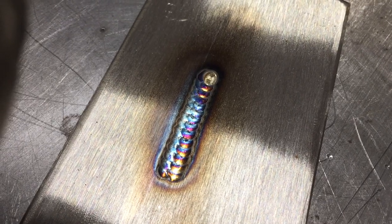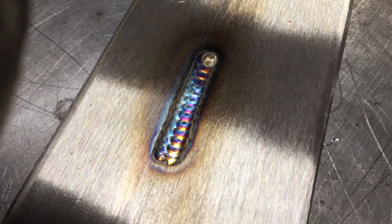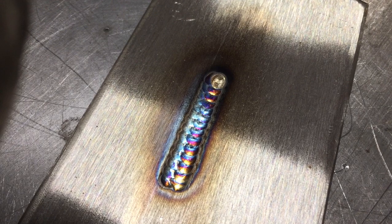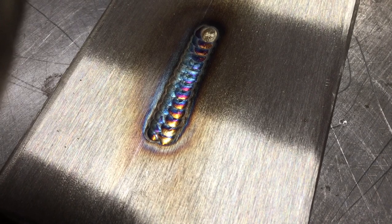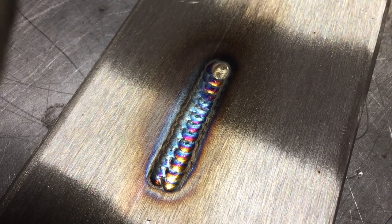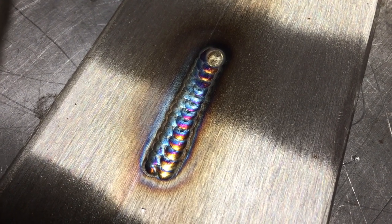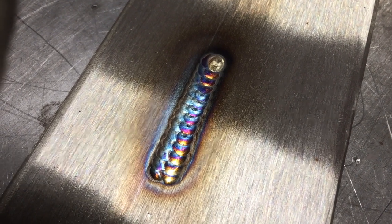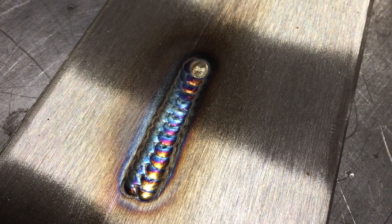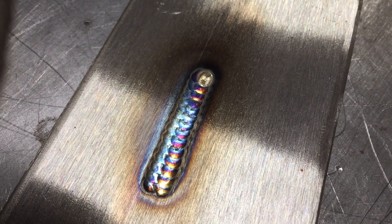Give me some post flow. There we go - nice and clean. So there's the weld I just did. Pretty simple, straightforward. It was about a minute long so my hand wasn't tired or anything. I used the foot pumping technique with the pedal, no pulse on my machine. You can see it got basic gas coverage. I like having a little bit of color on my welds because I do a lot of art stuff - it's slightly a little bit warmer than I usually would let it get if I wanted to keep a gold color. But that's a stainless weld right there.